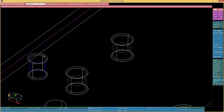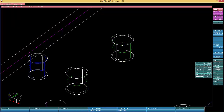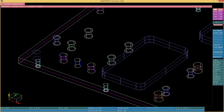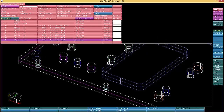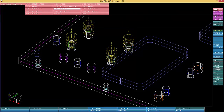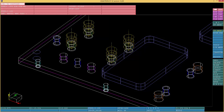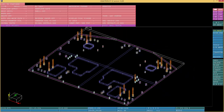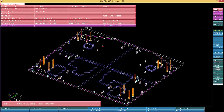Of course, you got a blueprint and all that, but I'm gonna use a .378 diameter. If I can find a drill like that, which I doubt, probably I'm gonna have to use a reamer. But for the meantime, this one over here will be the .375. Let's see what I got here. .370. Now I was probably using a reamer to do that. So I'm gonna use, I had a .370 diameter for a reamer. There we go. I'll go 1600 and I choose all of that.